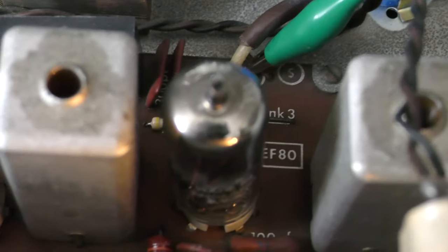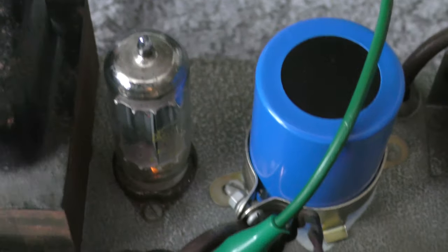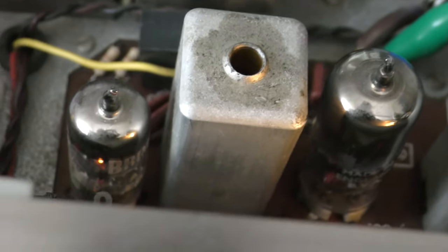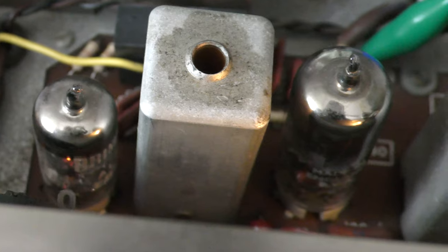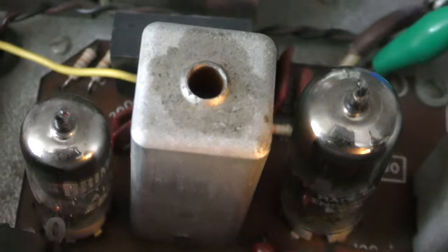But the EF80 does not appear to be glowing. I've checked the filament. See, everything else is glowing nicely, including the magic eye. But this one, I can't see any filament activity. I can see a little bit of orange there, but I think it's a reflection of something else, of a capacitor. And it's stone cold, so...